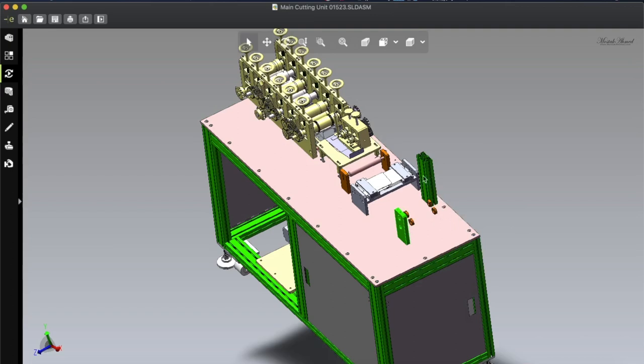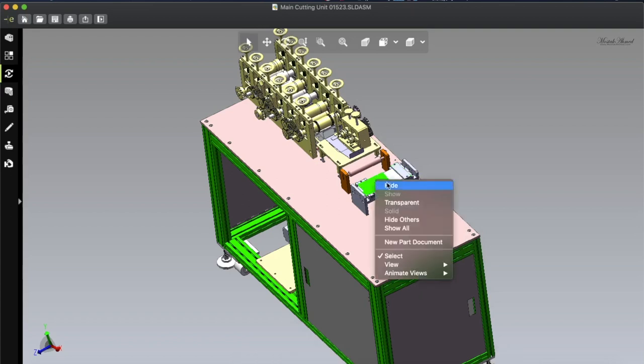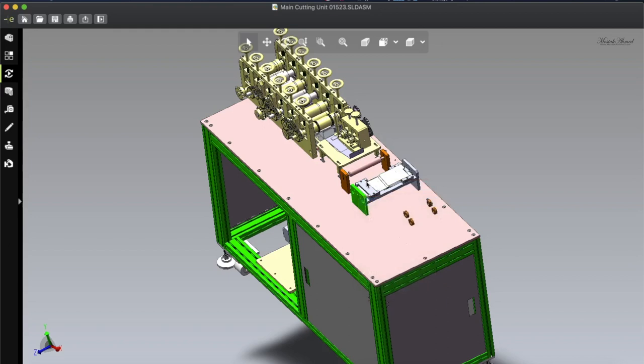In the first generation machine there were tiny spring-type components — looks good but a little complicated and time-consuming to make. Many people are now using this roller type to make it very simple and fast. This part you can buy ready-made, and this roller set is also available ready-made. Here you can see the main folding roller; after going through it the material comes to the folding plate, which automatically makes a three-fold, three-ply mask. Here is the tension clip.